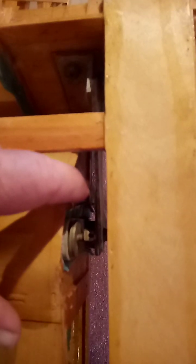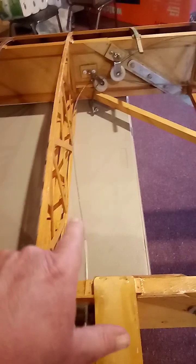He said the hinge line for the aileron — I put the ailerons back on temporarily — there's the pushrod connection for it, it's a pull-pull, so there's the top and the bottom down there. I'm going to investigate this. It's one solid piece with the top and bottom for the two cables to hook to. So if I move this 10 degrees it'll also move 10 degrees down there, which is exactly what the pushrod would be doing — so maybe I have to do nothing modification-wise to get my differential aileron.